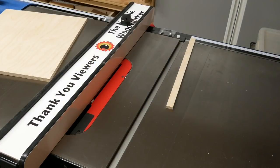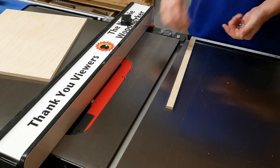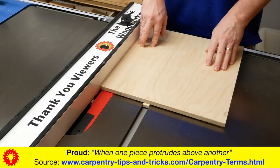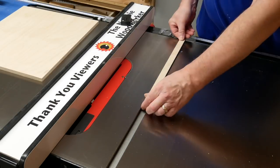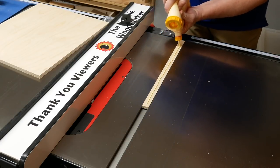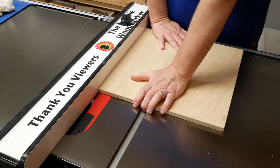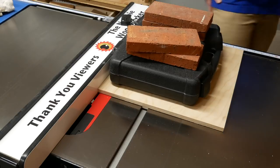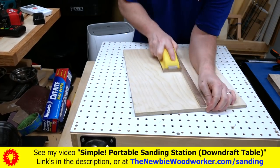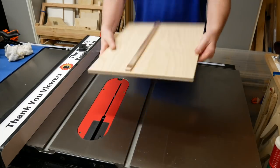Attaching the runner is pretty simple. Position your rip fence right up next to the blade slot but don't cover it — we want to be able to cut a small amount off the side of the base when the runner's glued on. Put some nuts, washers, or spare change in the miter slot so the runner ends up just a little proud of the tabletop. We don't want the base to rock too much, so I switched to washers — that's a lot better. Add a little glue to the runner. Put your base up against the rip fence and lay it down on the runner, keeping the base against the fence. Then put some weights on the base and wait an hour or so before you take it off. When the glue is dry, remove the sled and clean up any squeeze out. Sand the bottoms to get them smooth, then try out the sled and make sure it slides okay. You can use Johnson's Paste Wax on the bottom to make it run smoother, and you might need to sand the side of the runner a little if it still binds.